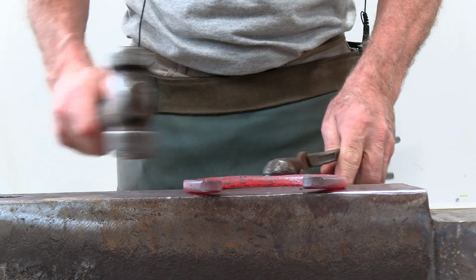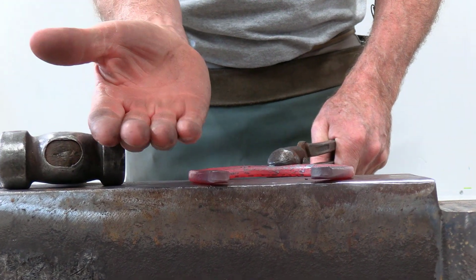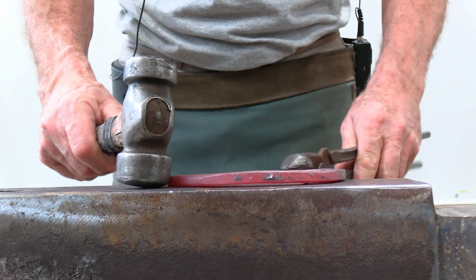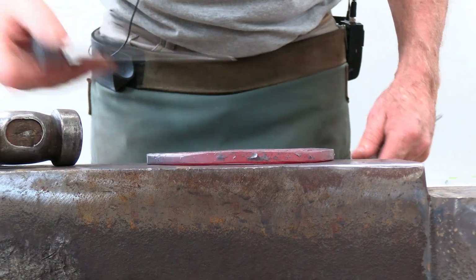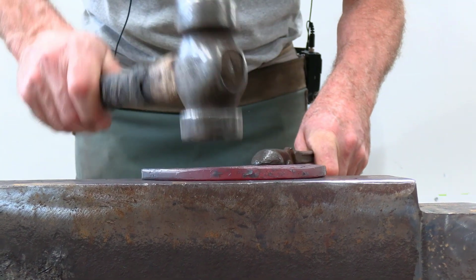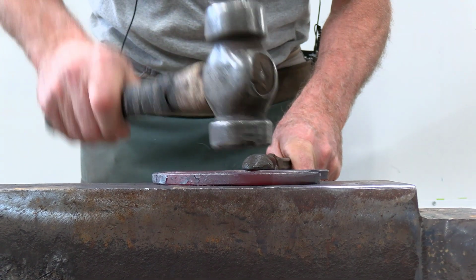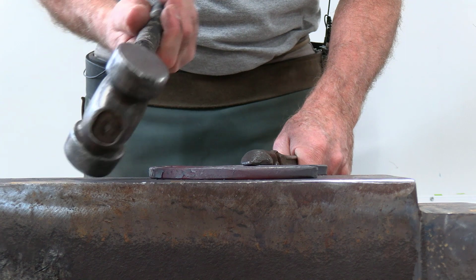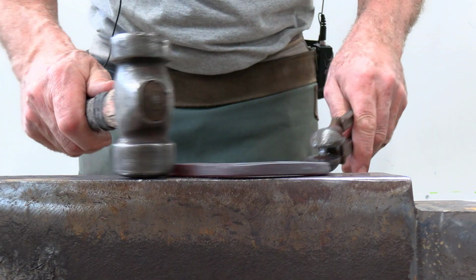My shoe has a hollow spot here and a hollow spot here, which has brought the heel on either branch towards the foot. If I turn it over, now I have a gap here, and I'm going to have another gap here. So all I have to do is just gently tap it down, and if I needed to be more precise with my hammer, instead of using the flat face, I'd use the round face. But you don't want to hit the shoe too hard.